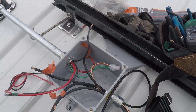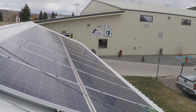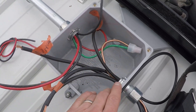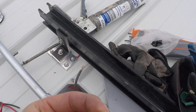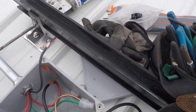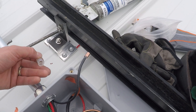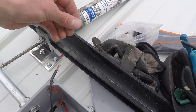I also want to quickly show you how we interconnect the system. I have PV wire running into my junction box. The array has two strings of 12, so 24 panels total, with all the home-run wires coming into the junction box along with the ground. For the interconnection, I like to use these little copper compression connectors — you can get them at an electrical supply store. You put the wires inside, crimp it with a tool, then put a cap on it — it's like a wire nut but better. It's an irreversible crimp, so you have to cut the wire if you ever need to rewire. Those work great for interconnecting wires in the junction box.